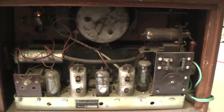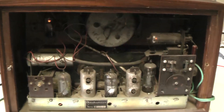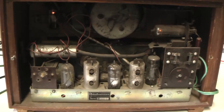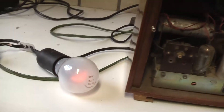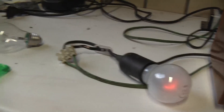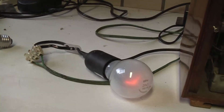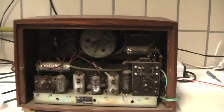I hope I managed to get some info across today, especially with this strange setup with the auto transformer. And also, slowly getting it up to operating voltage — firstly with a 25 watt bulb, let it run for about a quarter of an hour, then 40 watts and then 60 watts — and always give it a time span in between to run and to reform the main smoothing cap. Yeah, that applies to bringing any kind of old equipment back into service.